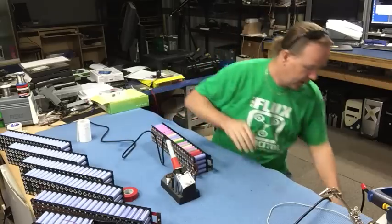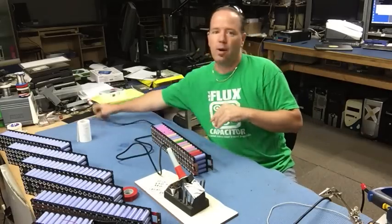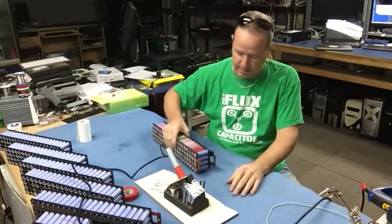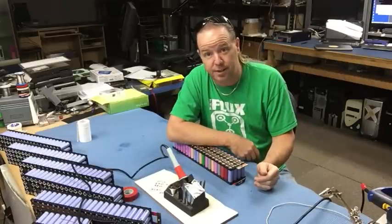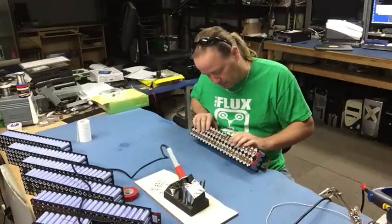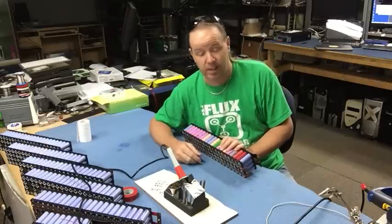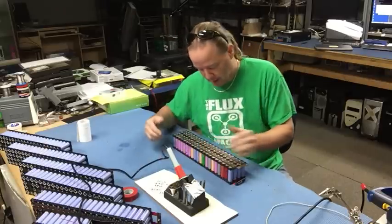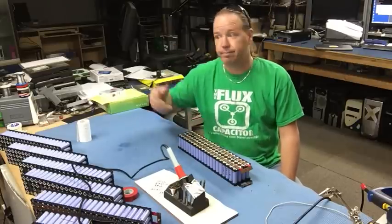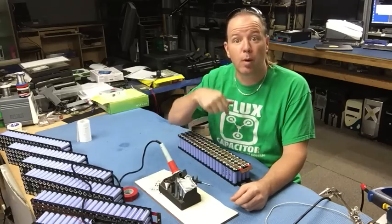This thing constantly hides on me. How do I plan on fixing it when one of the cells go wrong? Well, there's not much to it other than hard work, to be honest. I've got to desolder it all, both sides. I've got to get some sort of hammer and whack all this off, test it, and put it all back together again. And now it just comes down to actually desoldering everything one at a time. Let's get started — let's wait for the soldering iron to heat up.